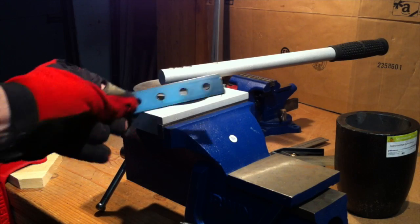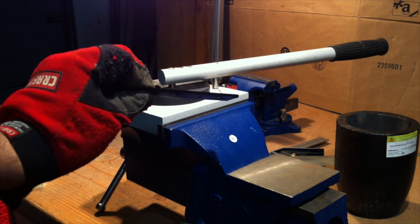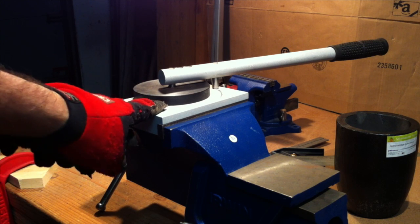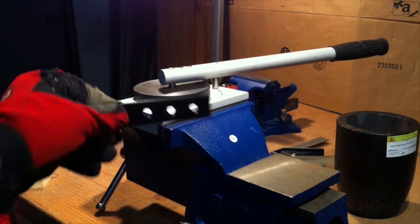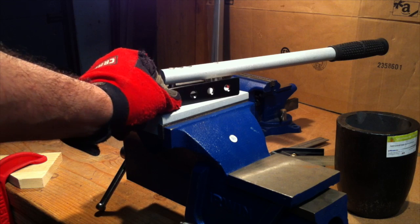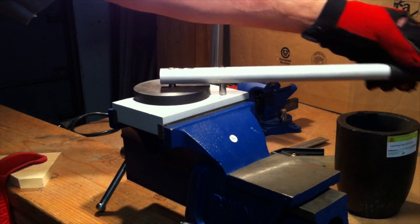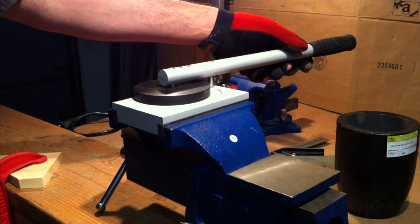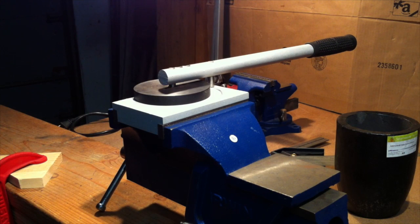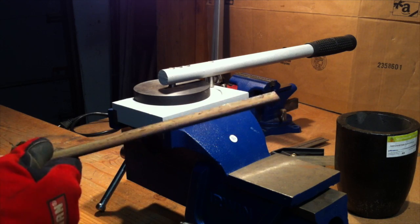My plan was to use the stock as the fingers that will grasp the crucible. I was going to use this bending device to do really good bends, but it's just a bit too tall and too short — there's not enough room for the lever action to take place. I think I need at least 10 inches to get a good round bend. So instead, since I have plenty of it, I'm just going to use the same bar stock that I'm making the tongs out of.